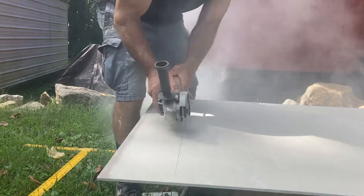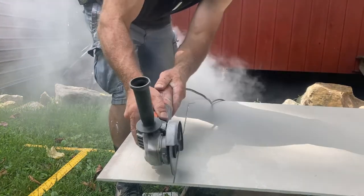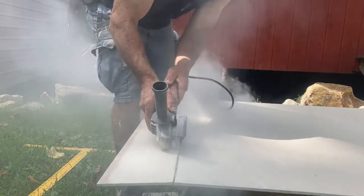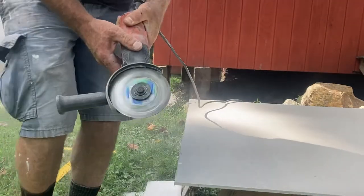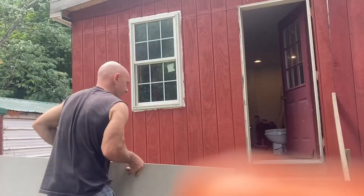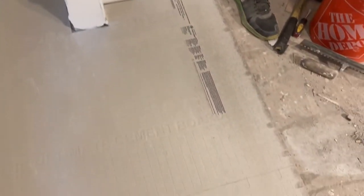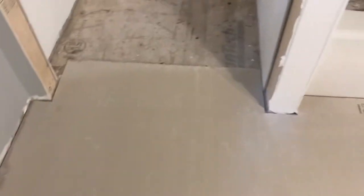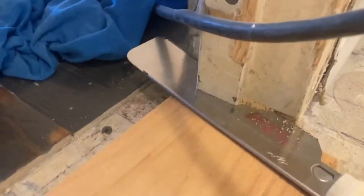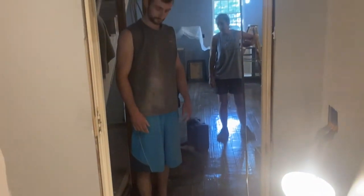What I found with this cutter is it's a lot easier to cut backwards — different than you'd think. You would think like a skill saw you'd push into the product, but it's actually better to drag it backwards. I used the diamond blade for that. The stuff is so heavy and dense. I worked from the outside wall in. We already put the door jamb in, so to get that space I ended up laying a piece of pine on the floor and resting the saw against it.